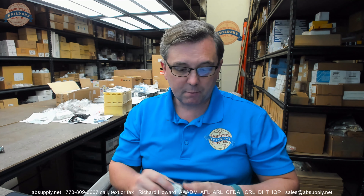But be mindful — if you're doing something new, new construction, make sure that's a beveled edge door. Any questions on the Yale 3694 three and three quarter deadlocking latch bolt? What I meant by that was: you hold the tab back and you can't loid that. The term 'loid' — L-O-I-D — is when you're jimmying or tampering the latch to get in. With proper installation, the face of the strike will hold that back so that you can't get it open. Any questions on the 3694 Yale latch bolt or any other Yale product, please feel free to reach out to us. Thank you.